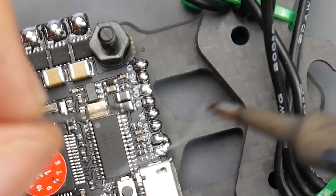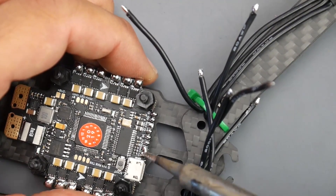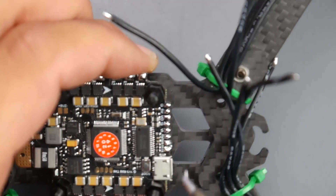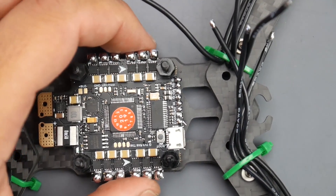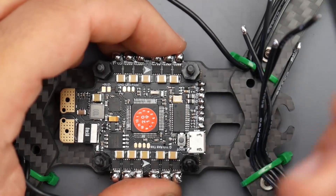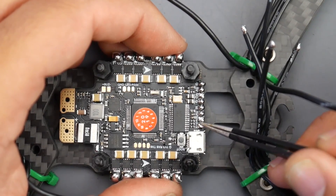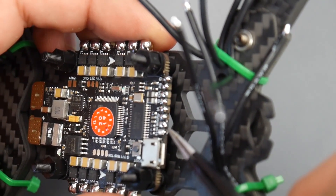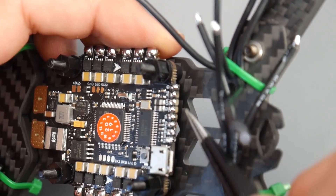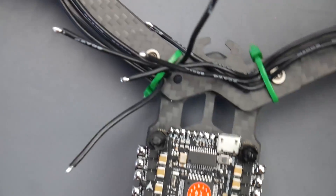As you can tell I've bridged them. The reason they're bridging is because the board has edge plating and the pads are really close together. A nice technique is to just come in and push away, cleaning the soldering tip, and keep doing that. I did bridge the last two because ground takes a bit longer to heat up — it bridged with this one, so I kept moving the soldering iron back, putting it in, moving it back, cleaning the tip until I cleared the bridge. Also watch the edge of the board since it has edge plating, which means solder will flow to the other side.